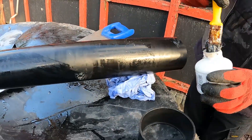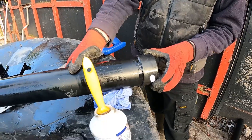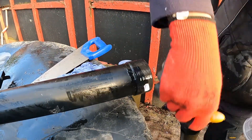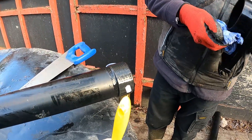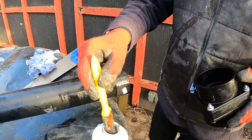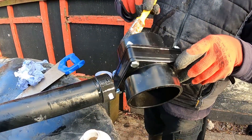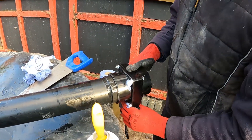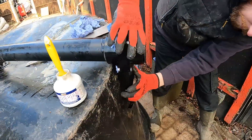That adapting bush is going to go on the end of the pipe and converts it to three inch. If you really wanted to go to town on this, you'd use a bit of sandpaper first, then wipe it clean with some solvent weld pipe cleaner. Then put plenty of glue on. We're putting the logo to the outside. Amazing stuff, this solvent weld glue — it just melts everything together. Do be careful if the pipe is damp; you'd have to dry it and rub it with sandpaper and cleaner first. Just make sure the valve's facing down — yes it is. I think we're good to go.